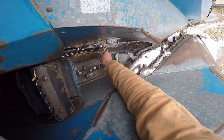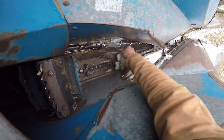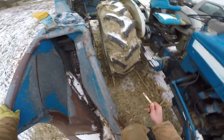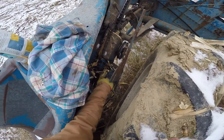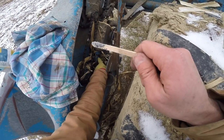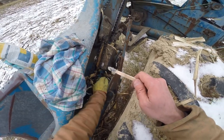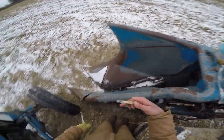Now, one time I had this thing so plugged that somehow these rollers jumped a tooth, and it's the coupling up here. I'll take a look at it while we're working and talking. Just kind of a little sleeve, and there's a gear up here, and then there's teeth on this outside coupling piece of pipe. But the problem is, the teeth, if we look where this scratch is right here at the end of my finger, the teeth are about right there, and it's blank up in this top section. So somehow it must have fallen down too far and jumped a tooth.